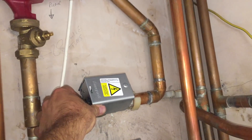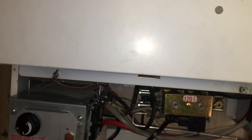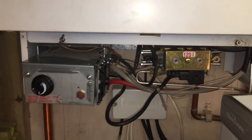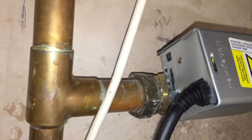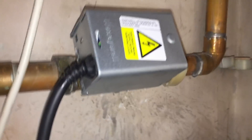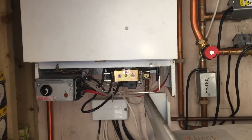To cool it down, turn it off completely and we'll open upstairs rads and put it on the latch, because obviously we're going to be doing the boiler stat so it's going to be red hot. I actually open both valves here, boiler stat off. We'll let that cool itself down a bit before I open it up and work on it. The light in the cover is not working today so it's going to be a bit dim.